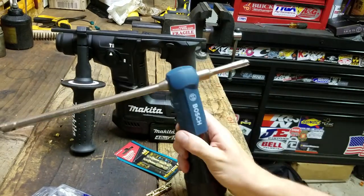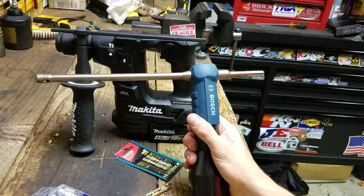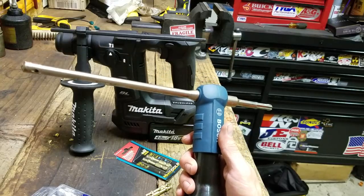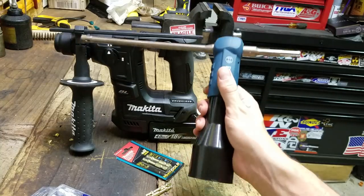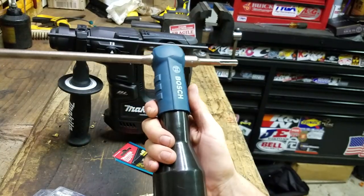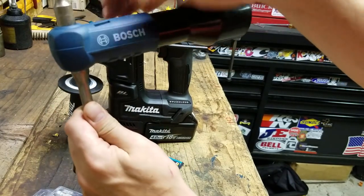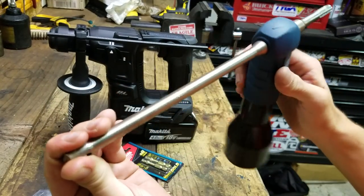This half-inch bit was the right size for anchoring a small generator — I put rubber pads under the feet and used this to set the anchors, and it worked like a champ. It keeps you clean as you work, and it helps comply with the new OSHA silica dust regulations. It's a weird thing to watch this smooth shaft plunge into concrete with no dust buildup at the hole. You do need to use the vacuum with it — without it, there's no way to extract dust and it'll get clogged and stress the tool.